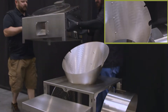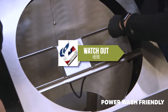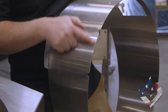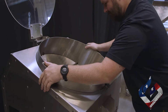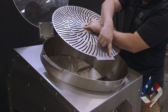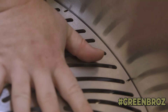Now it's time to reassemble your Model M. When installing the top of the Model M back onto the cart, take care to avoid pinching motor cables or your own hands on the funnel. Place the exit door in the exit door slot. Next, replace the barrel — the barrel has slots that correspond to the motor mounting bracket. Slide the barrel into the Model M, ensuring the barrel is fully seated. Prior to installing the bottom blade, open the exit door. The tab on the bottom blade will fit in this opening. Like the barrel, there are two slots on the lower blade that align with the motor mount bracket.